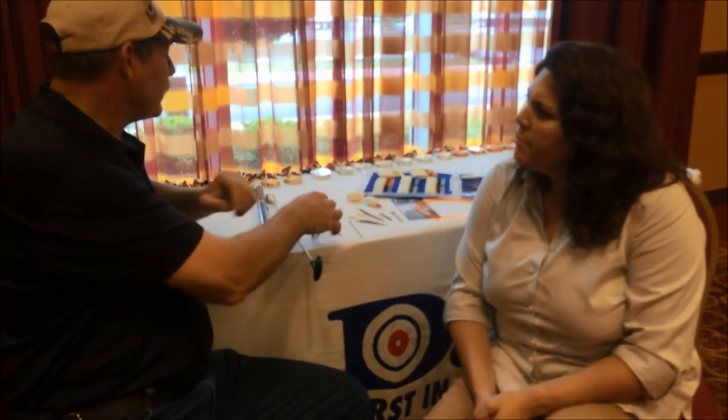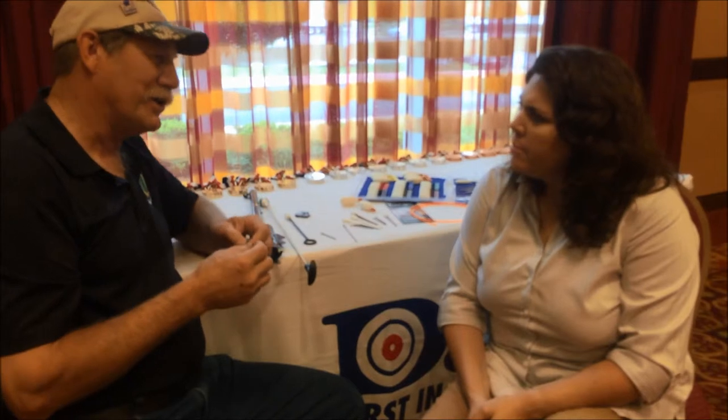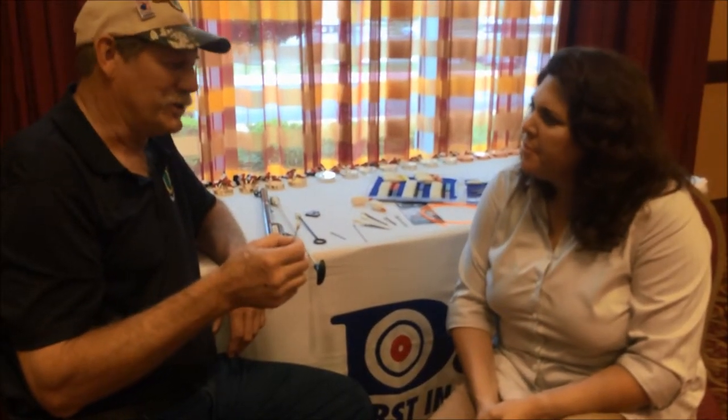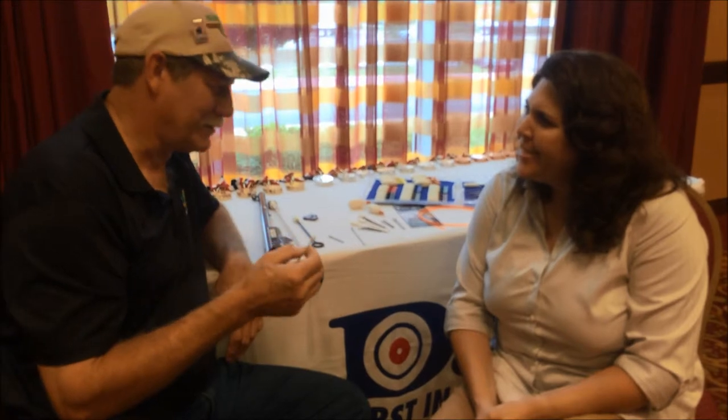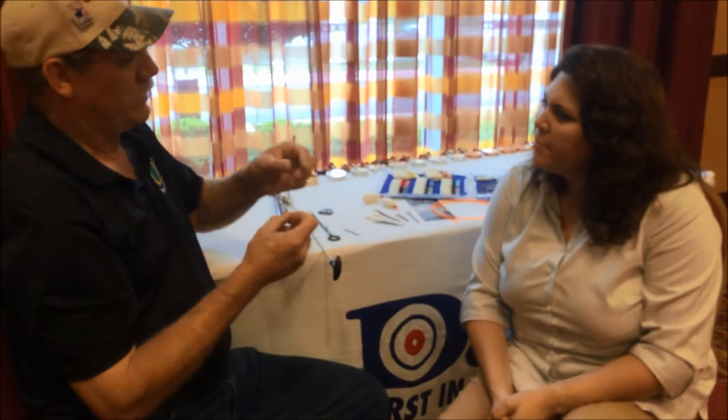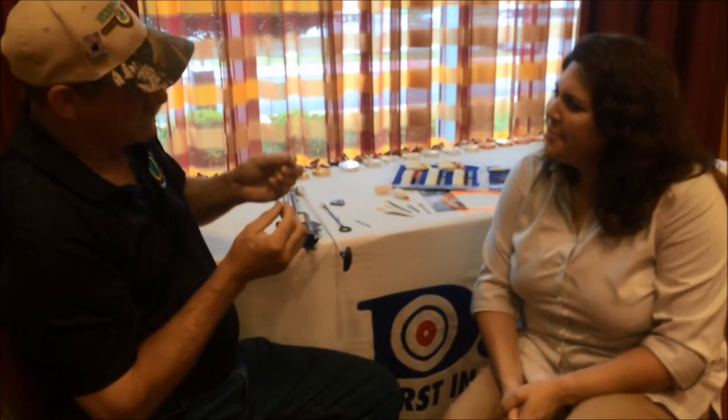The products I like — because with the shot tube, I've punched a lot of Q-tips down those shot tubes and they leave fibers, depending on the grade of Q-tip you're getting. The cheap ones I buy leave fibers all up and down that thing. Whereas if this swab here were made about this much longer, it would slide in and out of that nine-inch shot tube perfectly. You can also put some polishing compound on here and polish the inside with it. They hold together much better than Q-tips.